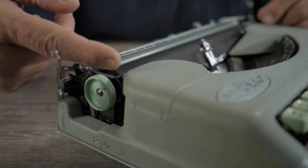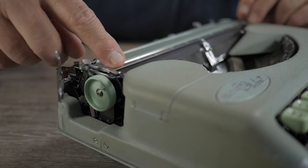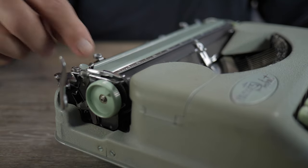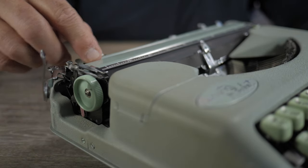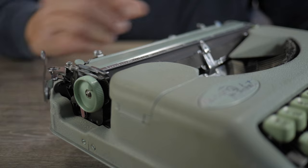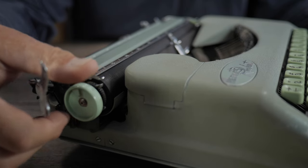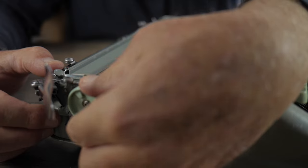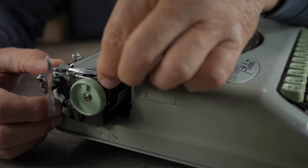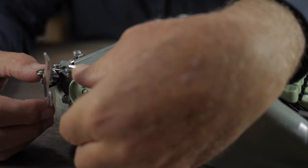The paper bail has a little finger protruding above it on either side with a paper scale, a typing scale on it. The erasing table behind the platen is also scaled. There is a little tab that's part of the paper table — you can push it forward and it acts kind of like a paper release on the left side. The left and right platen knobs are rather small in diameter. The left platen knob is a little bit irritating to get to because you're restricted by the lever, the paper bail extension, and the line spacing lever. You can only really get at it from one good angle, though it's a little easier on the right side.